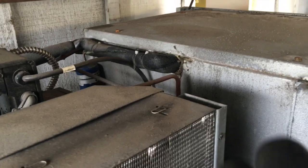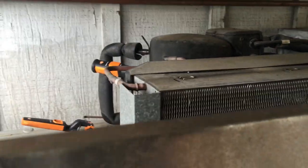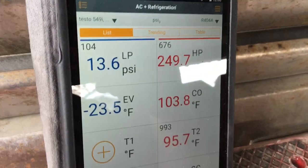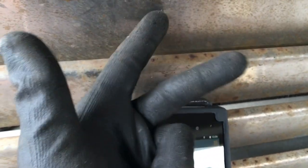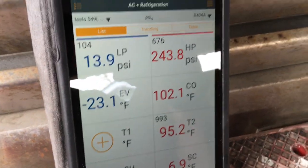Now, what normally happens is that evaporator probes go bad. It's weird, that's the most common thing on these. So, this is their main freezer. I gotta figure out a game plan, and I'm thinking the best I can do is offer up the relay pack, contactor, and probe. And the other option would be just the probe and see how it goes. See how we make out.